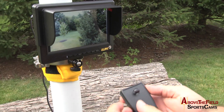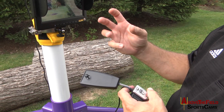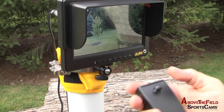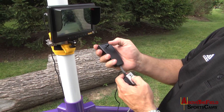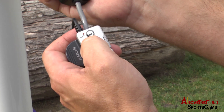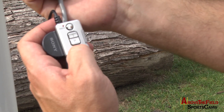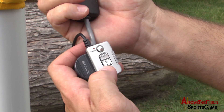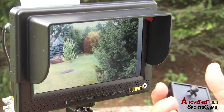Your pan tilt head is controlled by this handheld remote control. It's important to know that our cameras have a floating lens, so when I shake the pole, it's minimal movement in your image — it floats. There might be a short delay when using a remote in a windy situation; it'll catch up. You have your zoom control — T stands for tight on your Sony control, W stands for wide to pan all the way out. You have your video button that when you hit it, the indicator will go from orange to red. You can also take stills — you'll see the image kind of shake as it takes a still picture.